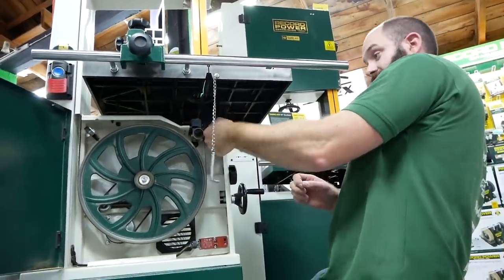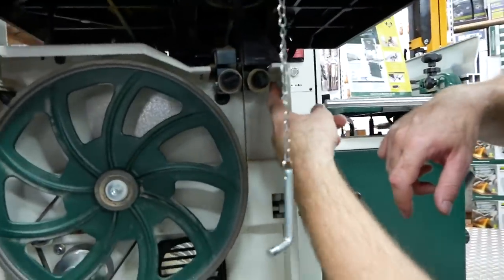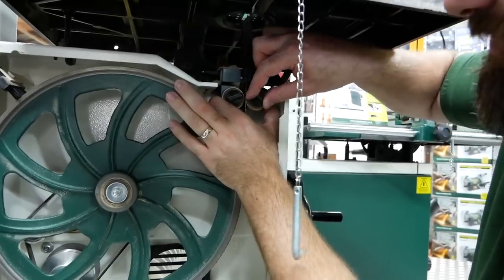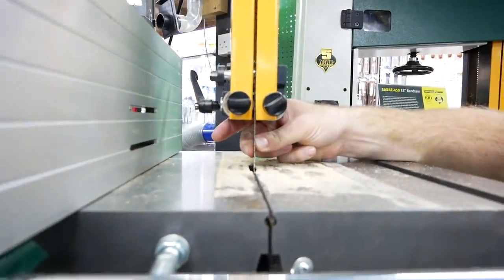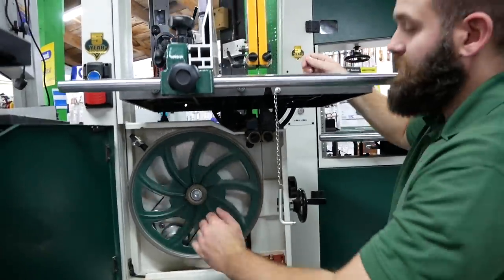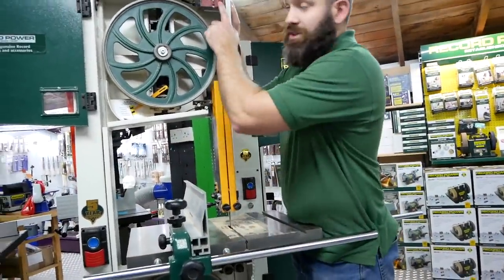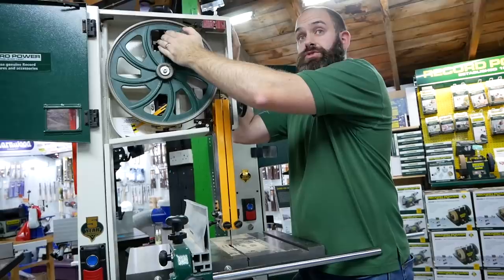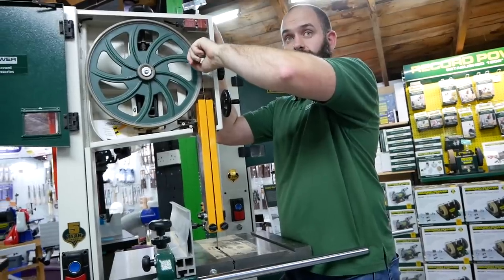The guides underneath are set in the same way — you twist that, press it in. At the back there's a little bar — press on the bar, not on the wheel, and then press in. They're sprung. So now if you look at the deflection, it's being gripped and you've got very slight movement — you're gripping a lot better. Once your blade is on — and of course you're doing all this with the power off, but even if you're not, there are micro switches, so if the door's open it can't turn on. Once you've got your blade on, run it dry: put your hand in and just turn it a few times and you'll see if the blade moves on the tracking.